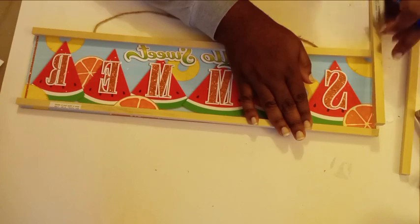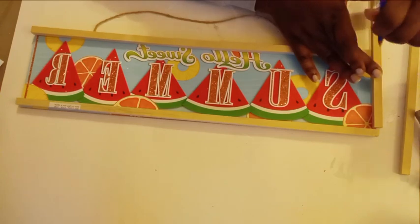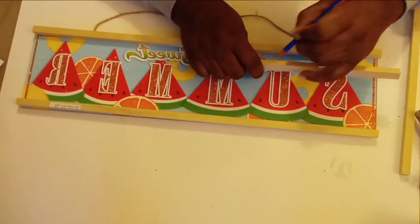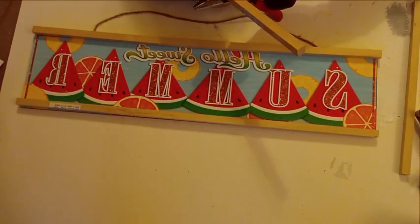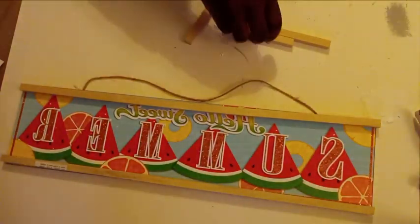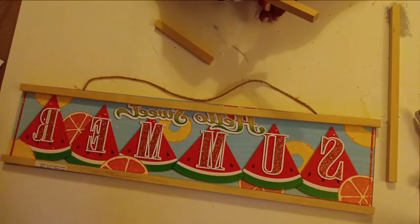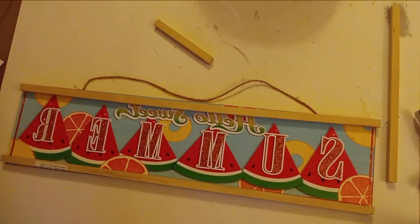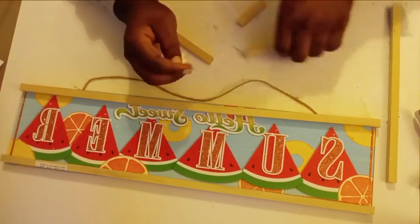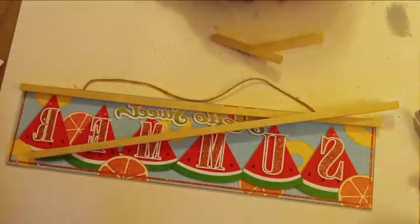To do this, I'm going to take two of those square wooden dowels from Lowe's and I want to measure my two longer sides first. Once I have measured those against the long sides of my sign, I'm going to take my miter shears and cut those down. Once I have those two longer sides cut, I need to place these in place on top of my board and measure my two shorter ends from the inside of the two pieces. The reason I'm measuring from the inside is because I want this frame to be able to sit directly on top of this board versus having to slide it inside the frame.